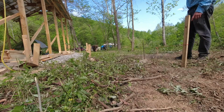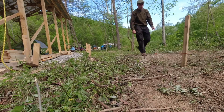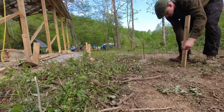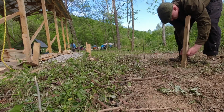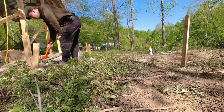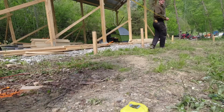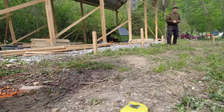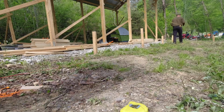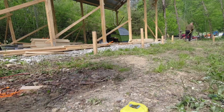The first thing Joel and I did was to measure. I don't know about you, but this is not that easy. Squaring up the building you think would be simple. A squared plus B squared equals C squared, but in reality, it's rather difficult. Just because you can measure 40 by 10 doesn't mean it comes out right when you are on the ground. The biggest challenge in this project, besides pouring the concrete, is literally getting the diagonal measurements to match. No sweat though, we got it.